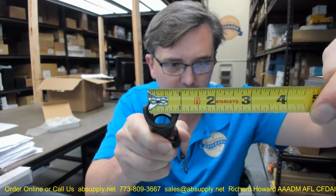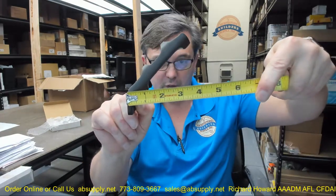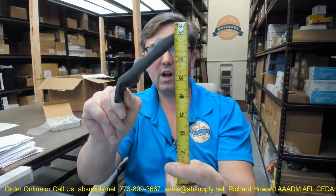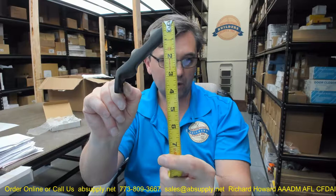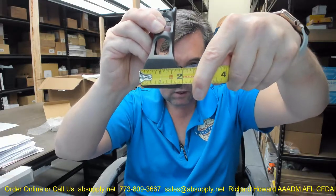The 'small' designation is in relationship to the diameter of the bar that works through it — they say it's 3/4 inch, so the inside dimension would be ideally suited for 3/4 inch. Overall, there is a technical drawing below, but the overall projection looks to be about 3.5 inches, overall height about 4 inches, and width of the base at its widest point about 2 inches.